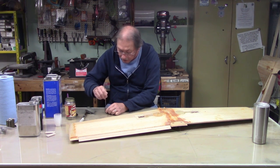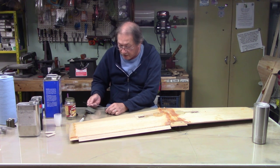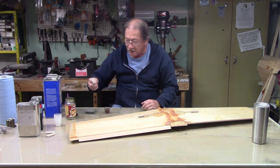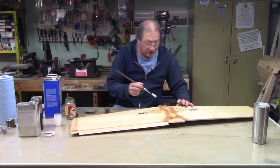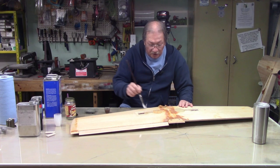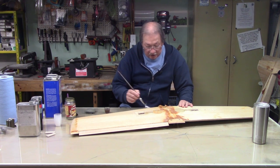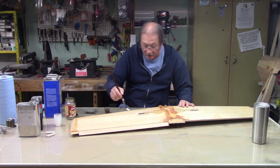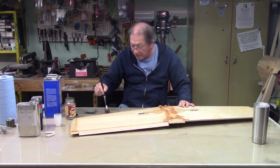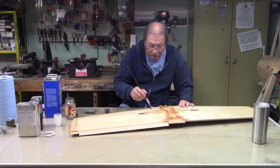really well. Hopefully I don't splash it all over everything. Now, it doesn't really matter where you start. I like starting in the middle, but you don't have to. And you just brush on a generous portion over the whole thing. You can tell when you've got enough on there, it starts to get nice and glossy. All the brush marks will start to disappear. And you want the coat to be fairly even. You don't want so much on there that it runs.